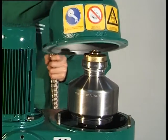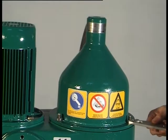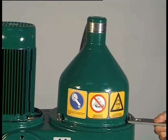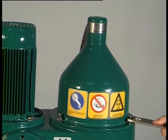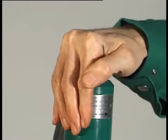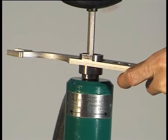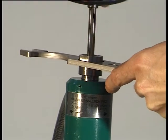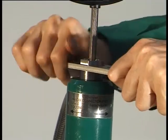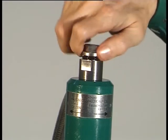Mount the hood. Attention: two studs — the connection threads of the corrugated hoses point towards the rear. Bolt tight the hood with the two hexagon nuts and a hex head screw. Fix the handle connection piece with fitted gaskets into the hood. Tighten the handle connection piece by turning the hook wrench counterclockwise and holding the T-hexagon wrench. Screw the plug with fitted gasket into the hood, right-hand thread.